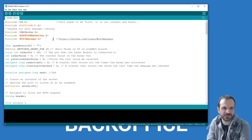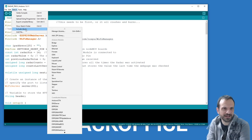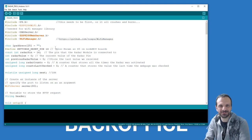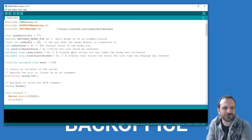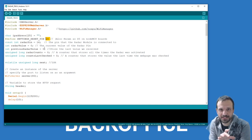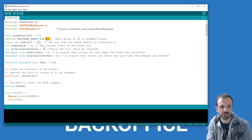I've got a GitHub address here — you can go to github.com/tzapu/WiFiManager for instructions on adding this to Arduino. Let's step through the code: there's a variable storing the IP address at 25 characters set to blank, and a define for the reset pin which is pin 14 — that's D5 on our hardware, GPIO 14 in Arduino speak but marked D5 on the NodeMCU. There's also a radar pin assigned on pin 16, which maps to D0 on our hardware.